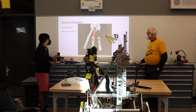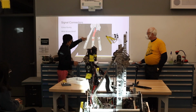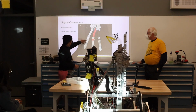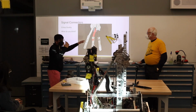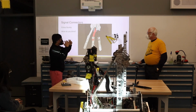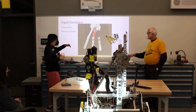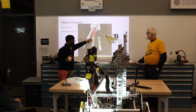The left one. The reason is, I realize that there doesn't look like there's much difference, but generally, when you have insulation going all the way through, then you know that if this isn't ballooned upwards, your insulation crimp, or the wire crimp, can look like two things. It can look like this, which means that it's all the way down, or it can have a little thing going up on the side, because some insulation got caught underneath it. And so the middle one's actually the best. Exactly, because you can still see the wire, but there's not any wire sticking out of the back, and it's crimped down all the way.